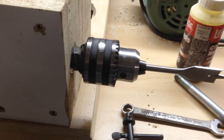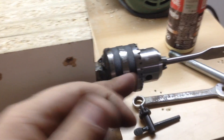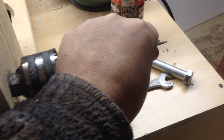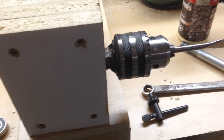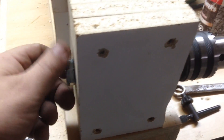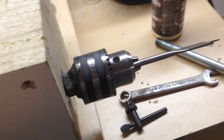The other thing that was mentioned in one of the comments was that this thing might unscrew if the drill were to stop, because I was forcing it too hard — would the motor unwind it? And it won't. What will actually happen is, if I was drilling, it would be like I was tightening this bolt into the chuck. So what would happen is it would actually try to tighten it a little bit more. So that's a good thing.